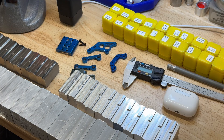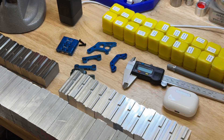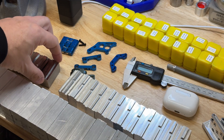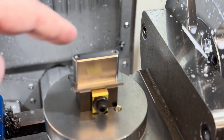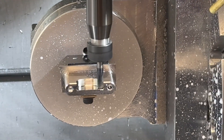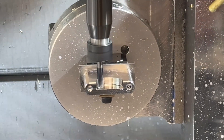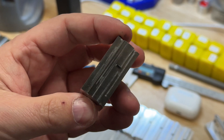So that's it. All in all, I'm a pretty big fan of this little TMZero and the more side fixture, to be honest. We've made a ton of stuff. As you guys can see, we've got a whole bunch of these pieces. These are actually 6AL-4V grade five titanium, and the machine cuts this stuff absolutely beautifully. The only challenges I've really encountered cutting this titanium are with drilling, because you really need a carbide drill bit. Drilling this with high-speed steel just murders drill bits.